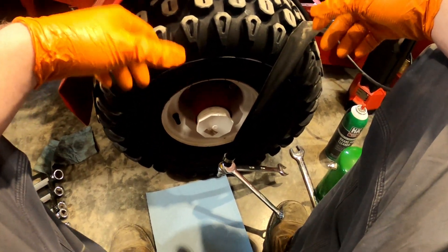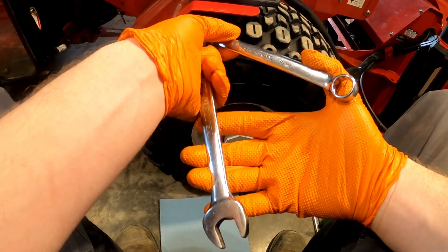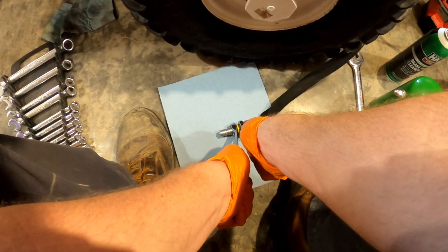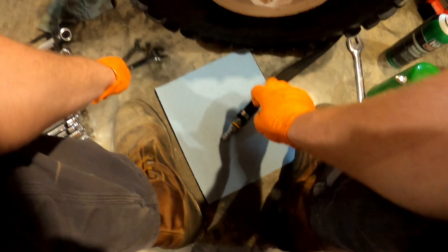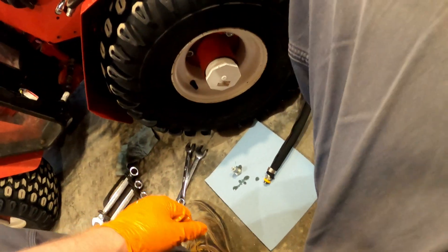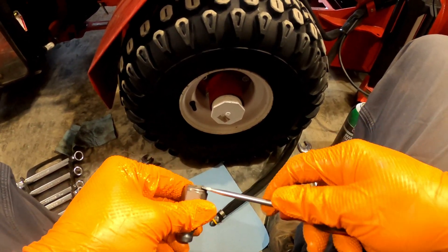As far as installing these couplers, there's nothing special you have to purchase like a bushing — you simply unthread the pioneer and thread on the flat face. Here's the male pioneer. I have a 16mm and 19mm wrench. You can hold it in your hands to break it apart, or even better, put the coupler on the ground to pin it to the floor and more easily break the connection. Simply unscrew the coupler — you're going to leak some oil. Then grab your male flat face, take the plug out, and do not discard this plug — keep it so you can plug your old coupler.